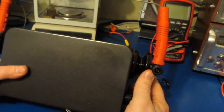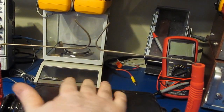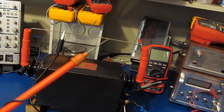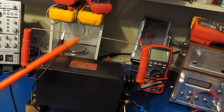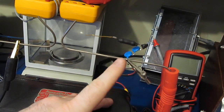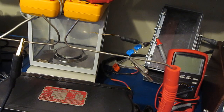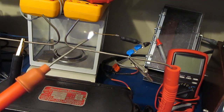On the far side you can see I have a couple of banana connections so I can plug my clip leads in, and there's also a spark gap on top to make sure the transformer doesn't go open circuit. With this transformer we have a bit more current we can apply. I've seen videos where people used leakage current testers on meter inputs, but once the meter breaks down it's very low impedance and output voltage goes to zero. What I'd like to do is attach this to these little circuits and see what actually gets damaged — I've just attached the circuit with an alligator clip to the electrode.